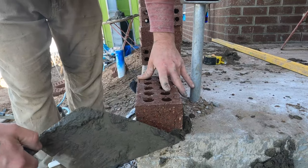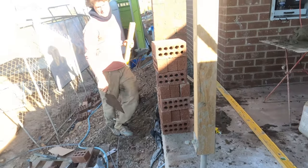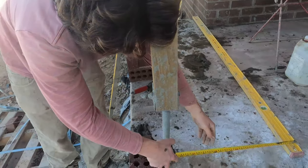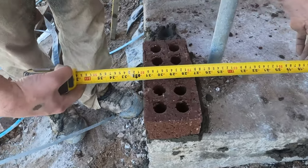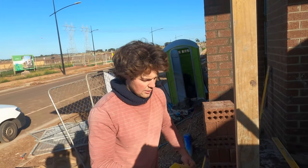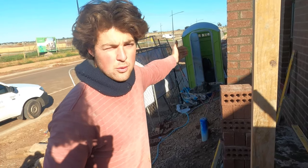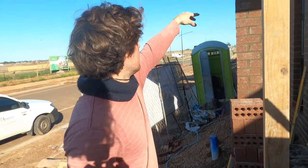Make sure we've got a nice bed joint there. A little level — make sure we're square. Double check with our level outside, from the existing wall — and you can see we're bang on 800 there. So what I'll do is lay a couple of courses now, square it all off, and double check that it's 350 both ways. Then I'll set up a profile. Just to make sure the very front is nice and square, I'll run a line with a rubber corner block on the end and one profile up here, running it continually to make sure the bricks are actually level, so by the time we get to the top they're at the same heights as well.